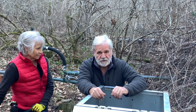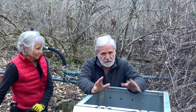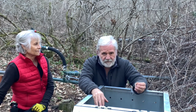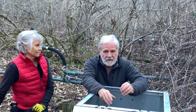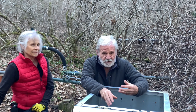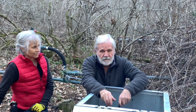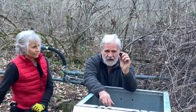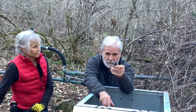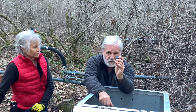The screen catches most of the stuff but it doesn't catch all of it. After a really strong rainstorm or a lot of snow, the flow through that dam is pretty intense and sometimes small bits of material get through the screen and come down the hill. Twice in the last year we've had the nozzle — the nozzle that the water comes through to spin the Pelton wheel — get clogged up from those small fines.